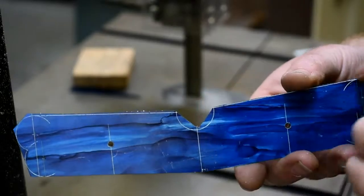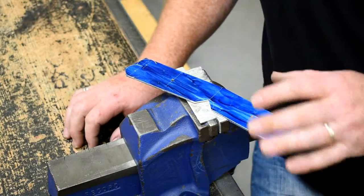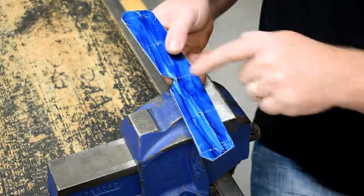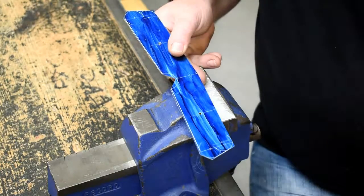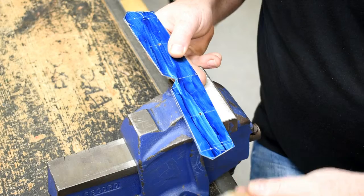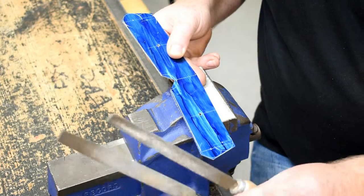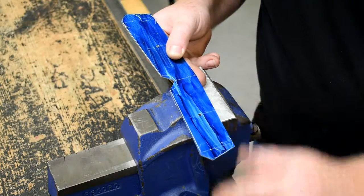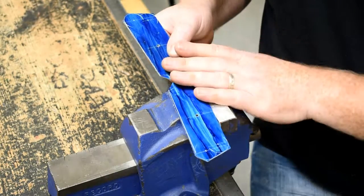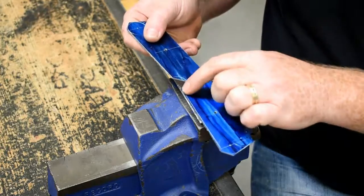As you can see, I cut a V out like that — that's what you want to do with your hacksaw as well, and then file these bits down. Going to file this piece now, Part 2. No problems around the sides of these sections. I have a rough 150mm and a smooth 150mm half-round file, and for the straight parts I have a 250mm rough and smooth file as well. This will be sped up, and I'm going to do this curve in the middle first.